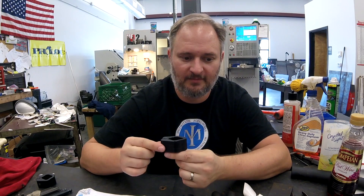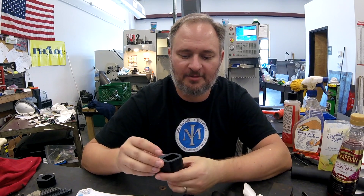Let's take a look at the operation that we're doing now. This is a multi-op setup — op 1 does everything like this up top, flips it over, decks it, makes it look like the other side, and then op 3 puts in the side here. So we're on op 3, which is the finishing part of these right now. Let me go reload the machine and let's take a look at what it does.